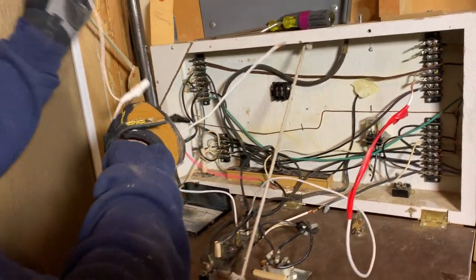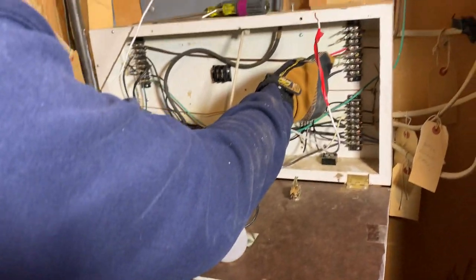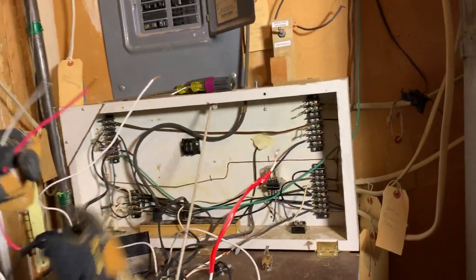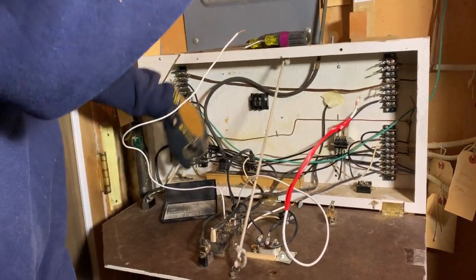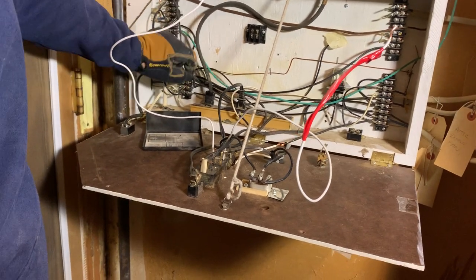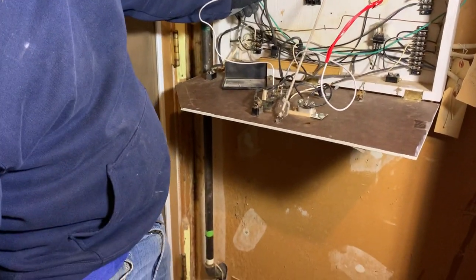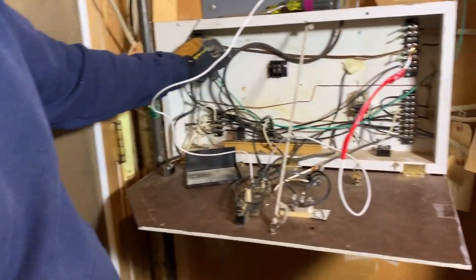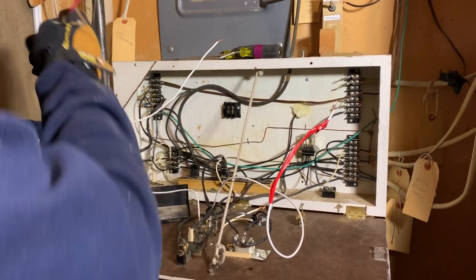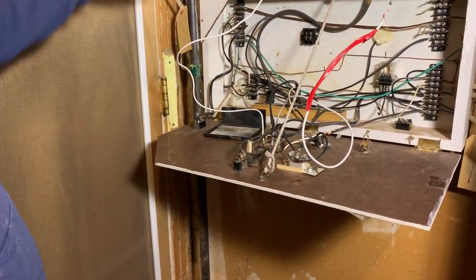If you've got 240 you will blow up your light bulb. Just checking — oh, I do have something here I gotta check. That wire comes down and goes straight out lining loads — that's how he's feeding that block. He soldered all this. Whoa — be careful now, see right here — a lot of this stuff was loose too. Sad thing — I don't even think it tripped a breaker. Let's try. A lot of these old breakers will not trip easy. It did trip — okay, good. His note said circuit 4 was out there and that was remodeled.